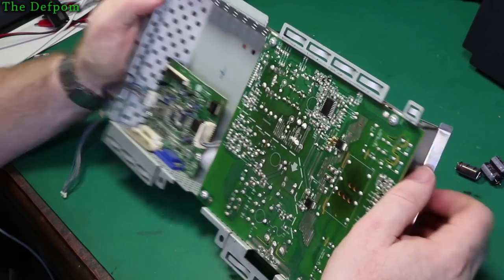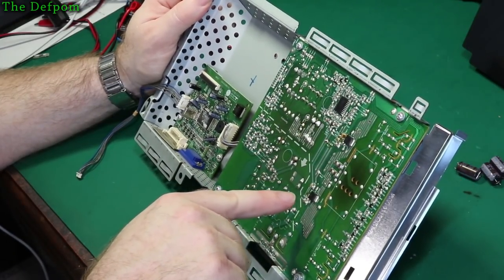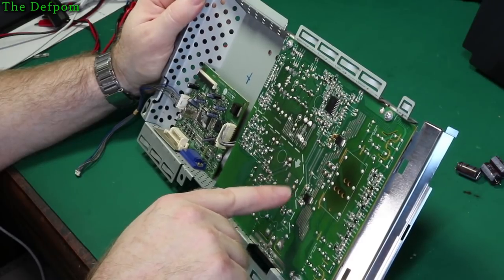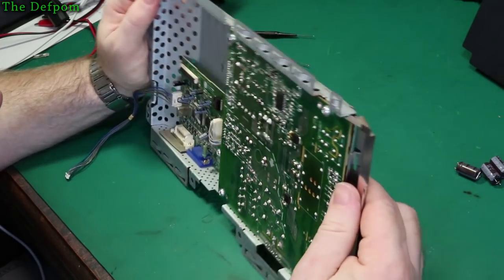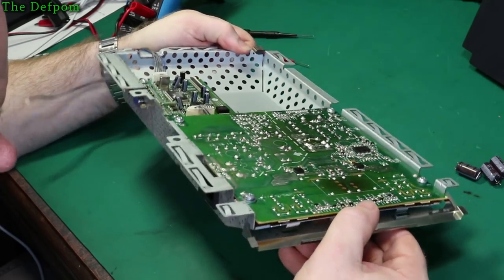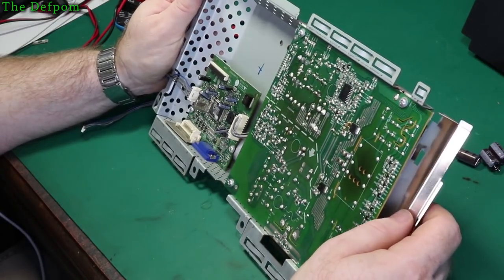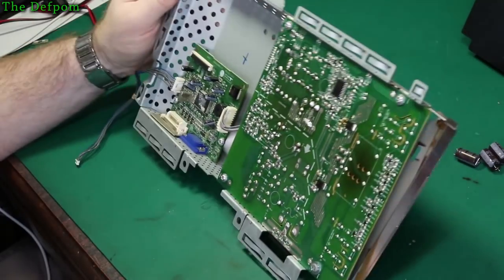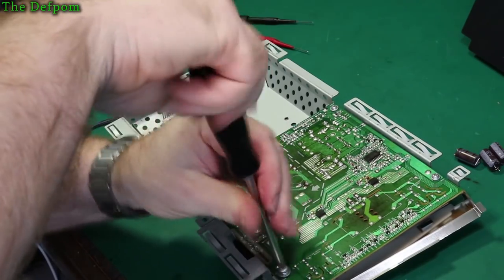Power is on. We have a 5 volt rail. We have a DIM rail which is 3.3 volts — sounds about right. And we've got 3 volts on the MS, whatever that is. So maybe the 22 volt rail doesn't come on until you power it up, or that rail's dead. Let's trace that back and have a little look. I would have thought that rail would be live. It looks like there's a MOSFET there — U303. There's a cap across there, a little surface mount ceramic cap which looks okay. One of the caps I replaced is actually on that rail. There might be a fuse or something there.